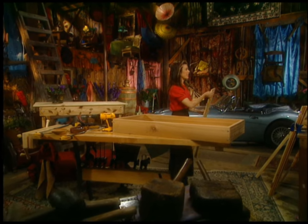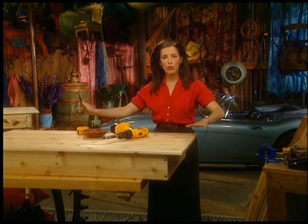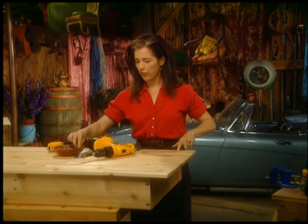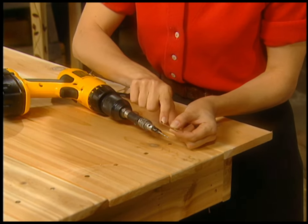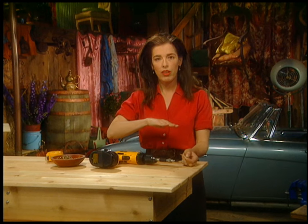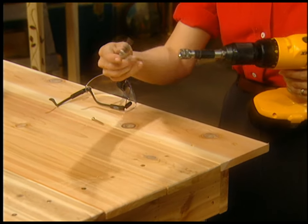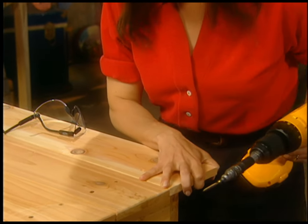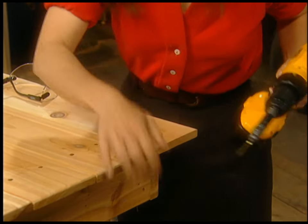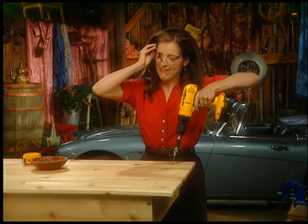Things are going much better now. I've got the decking mostly on and I'm countersinking with this special drill bit — it's called a countersink bit, and it carves out a little space just for the head of the screws, so you don't have a smooth surface and then hit a screw as a big bump, which is just not aesthetically pleasing. I'll flip this and put the screws in place. You space these boards just enough so you can see down to where the apron is, and then screw into that.